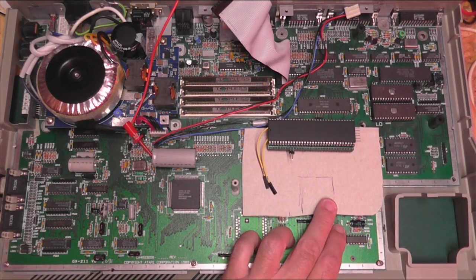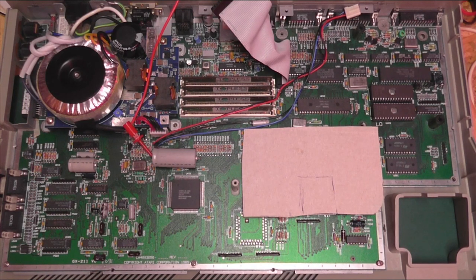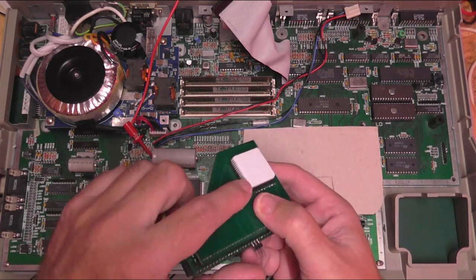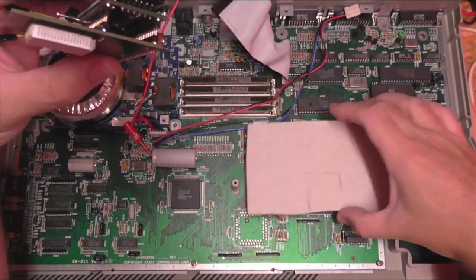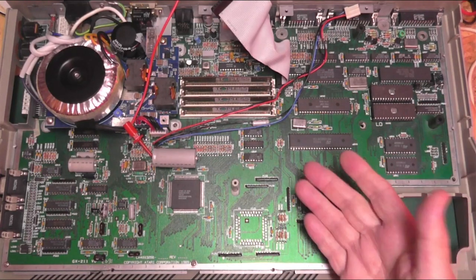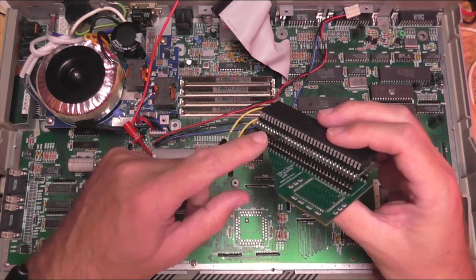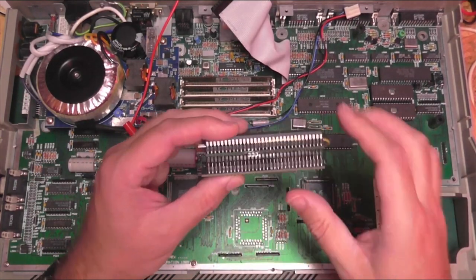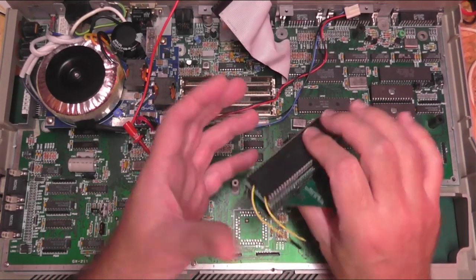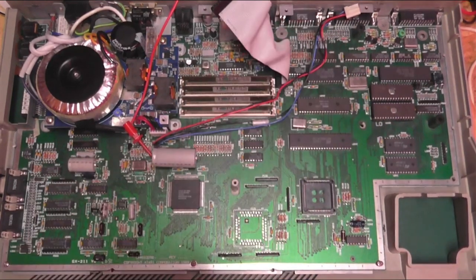It might work with just the 68000 itself — okay, that's not particularly helpful — but this is a learning experience. I want to have a go at designing one of these PLCC68 adapters with these little 1.27mm pins and see whether I can build it reliably, then start experimenting with a better location. Perhaps even what I could do is build the DST-B1 into the relocator board, which would obviously take away quite a lot of the layers and allow me to fit the chip into this position.